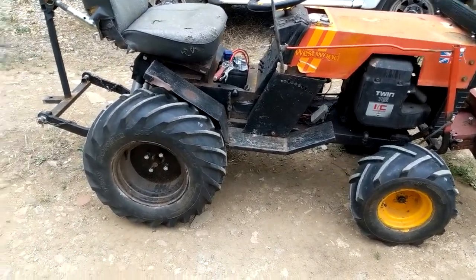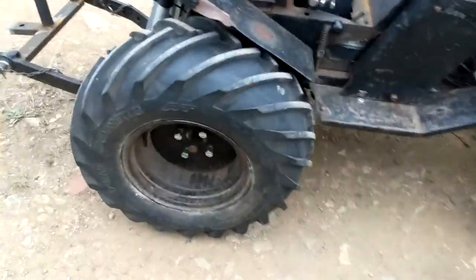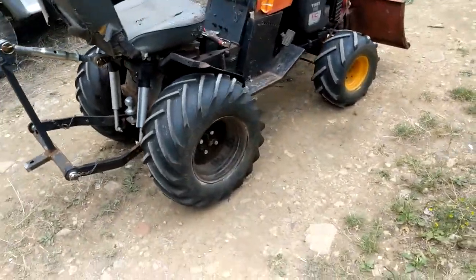Obviously, as you've seen previously, I've got the big wheels on there, that gives it more speed. I've had to put the inch shafts inside this gearbox, had to convert it, which you've all seen anyway. Then we've got bearings on the shafts to help carry the weight of the wheel. So it's quite an aggressive little mower now.